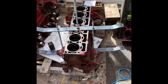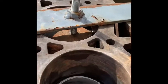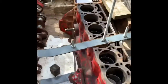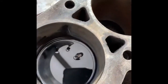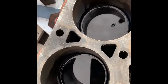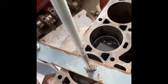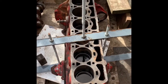Hey guys, I thought I'd share this — it's a cool little press to try and get this piston unseized in its bore. This one thankfully turned over okay, but this Penta engine has seized. These ones we freed off, that one's out. You just want to slop loads of oil or diesel or whatever in there to get it down, lubricate the bores, and try to free it off.